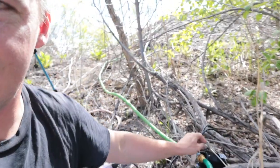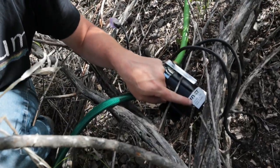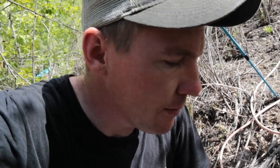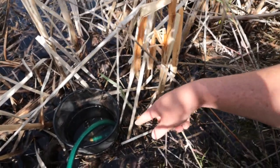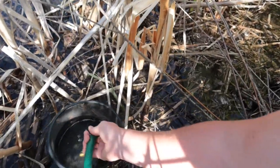This pump we're looking at is fairly inexpensive. It's not a submersible pump and it runs on 120 volts. What I like about this one is that it just takes a regular hose as the input and a regular hose as the output — no special connectors or special types of pipes. It says 115 volts, 330 gallons per hour, and the max head height is 39 feet. In this case I'm only pumping it up maybe 15 feet. I have it inside a little metal garbage can here to help screen it, and it came with a little filter to filter out some of the water.